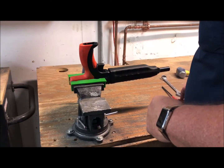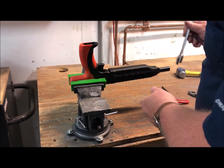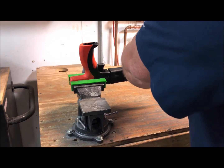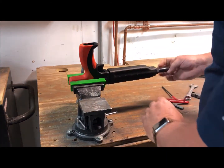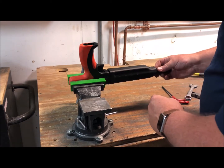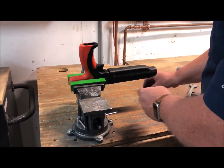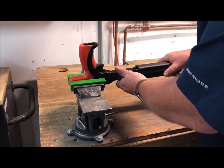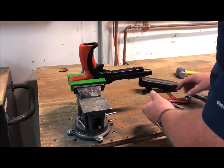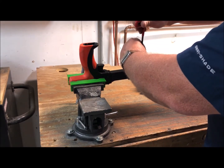Let's disassemble the tool. I put the tool in a vise to make it more stable. Take your three-quarter inch flat and put it on your muzzle bushing, give that a tug to loosen it up. This is a fairly new tool so it might come apart a little easier. There's our muzzle bushing. We can slide off our shroud now — there is a buffer in there that'll come out a little later, so watch for that. Now let's take our hex wrench and loosen up the return dog.